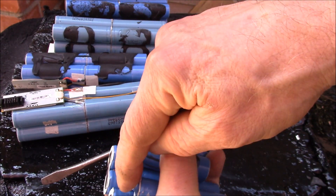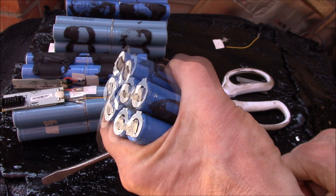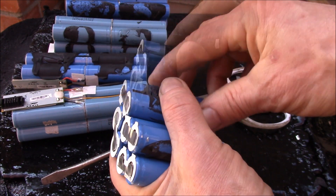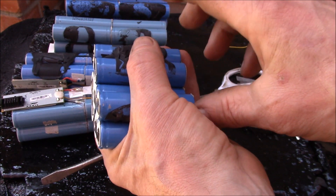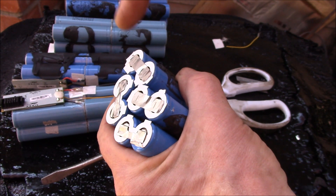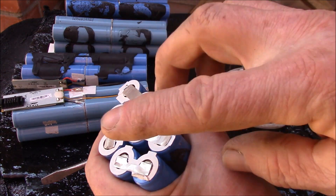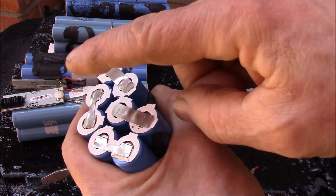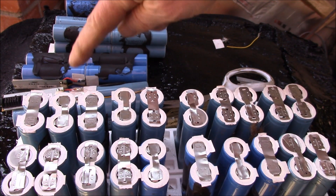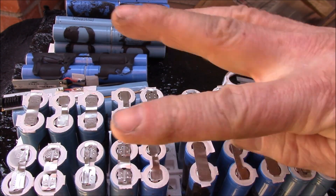For testing, I measure the resting voltage and if they're similar I put them in my charger - a four-cell holder. I bring the four pairs up to four volts, let them sit a week, check the voltage, discharge test, then bring them up to storage charge. The full cycle takes about a week. I'm doing all charging on solar, which limits how many I can do since I can only charge during the day.